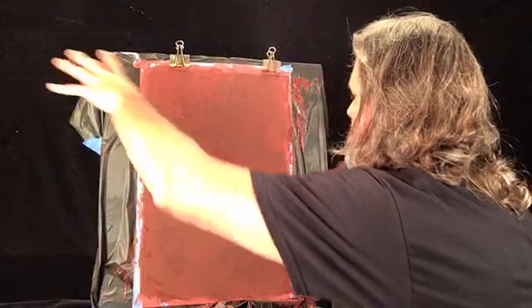You get any odds and ends — meaning any loose plaster — I'm going to continue all the way across the wall. On big walls I'll have a helper with me. This has to dry a little bit more. This is what we're looking for — that's the color. Here's completely dry, here's humid, here's wet. If I try to go into this right now it's going to pull the plaster up and make a mess.